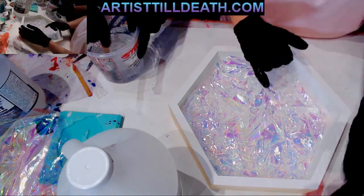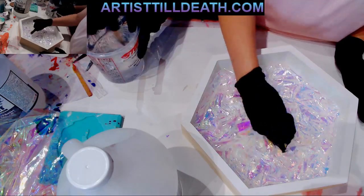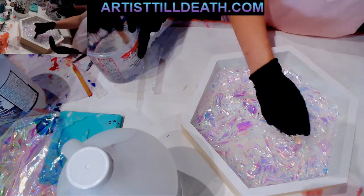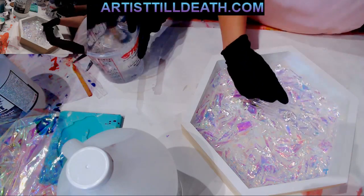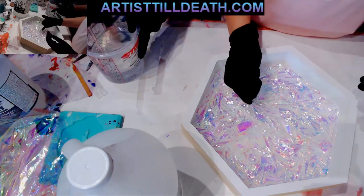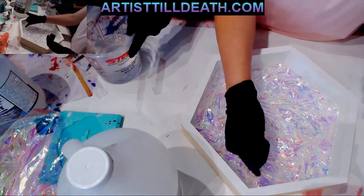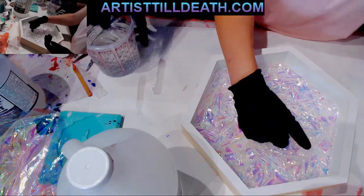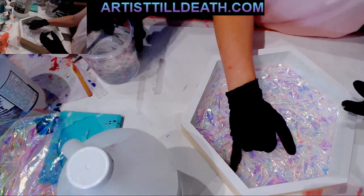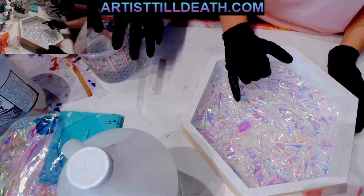The reason why I'm using this epoxy as opposed to the other, since I really don't care about air pockets, is because I can pour it thicker than the other ones. If I tried to pour the craft coat, the quick coat, or the art coat this thick, it would yellow, not because of UV, but because of the heat that's going to be created by those thicker viscosity resins. Ooh, I'm just dropping all the big words today. Accurately as well, I might add.